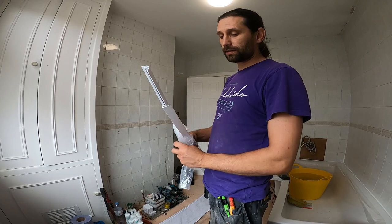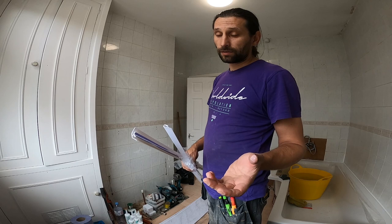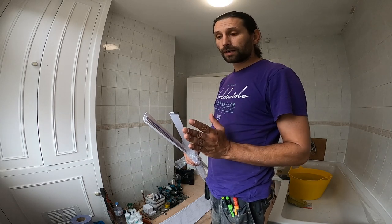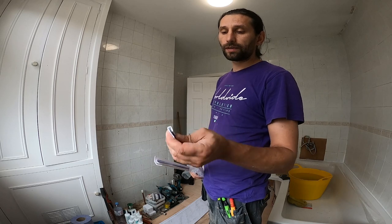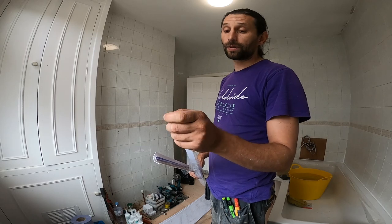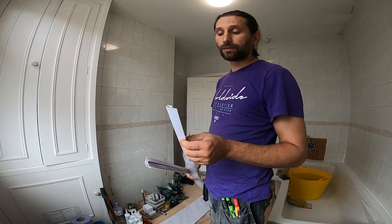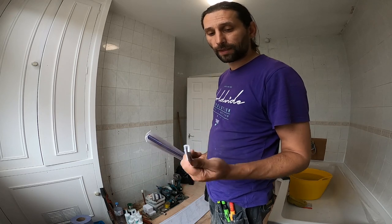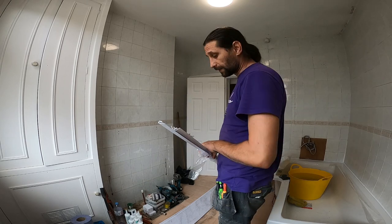So here we have our end bead and the corner bead. Each and every corner should have one of these. Actually, they don't have to, because you can also cut them and close them down flush one with another, with a bead of silicone at the back and the front of the panel, and it's going to do the job. And that is the end bead. These are going to be used whenever we are going to end our panels near a door frame, for example, and it's going to go out from the architrave, and we don't want to see that nasty edge. In that case, we are just going to use these three here. So I think that is going to cover most of the things that I need to do around here.